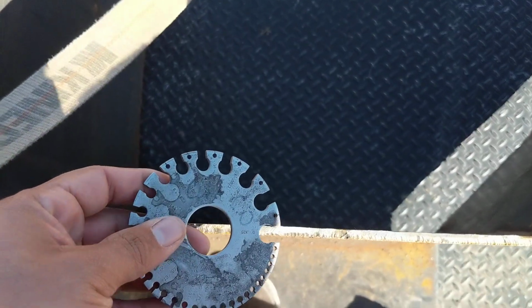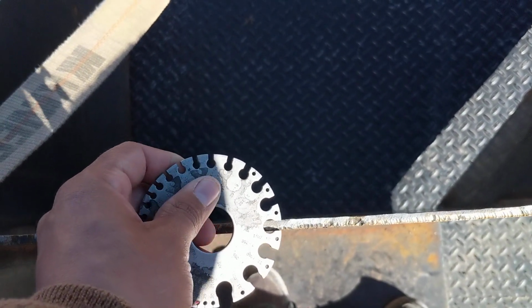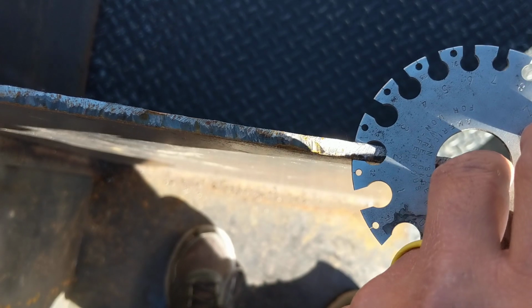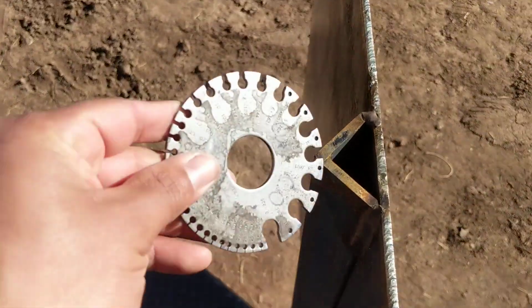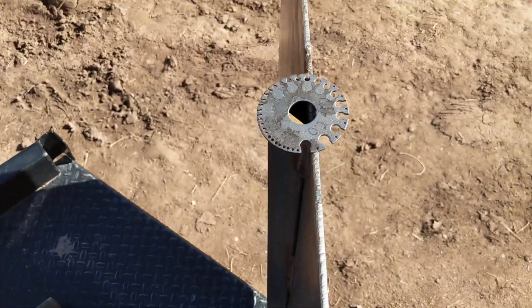So what you do is you start off with the one that it doesn't go through, and keep on going until it gets bigger. And there it goes in there to the 0.25, so 1/4" thick, and the gauge that's correlated to 0.25 is number 2. So this whole structure I already measured is number 2, or 0.25 gauge thickness. So you can check. Same thing on here. That's the angle iron, 0.25. So that's how you check the thickness.